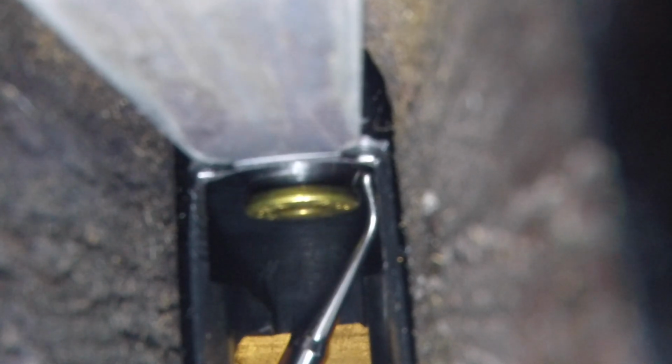So see if I can. Now I think this other piece of brass, I think the shoulder was pushed a little bit more, and I think this one might even, I think the one that I just had in there, one of these two was touching the shoulder before the rim, just barely. It was sized a little long for this rifle. So let's try this one and see what it feels like. Yeah, that one feels like it might be catching on the shoulder, so you can see that one needs to be sized a little bit more probably for this rifle if you were going to try to catch both the rim and the shoulder. But that's what it looks like.